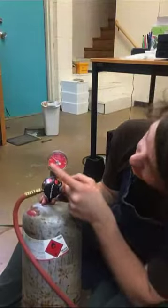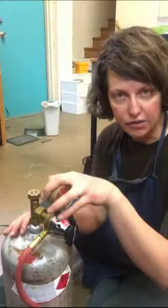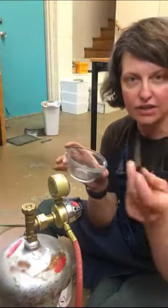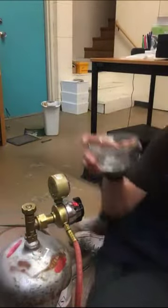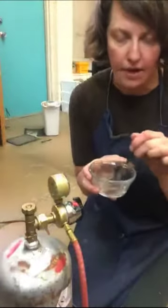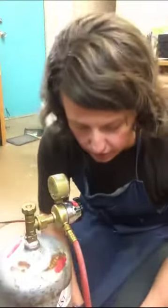This is telling me that I have an almost full tank. As I use this, the gauge will go down and will eventually get to empty. Now that you've got gas in the regulator, the last thing you have to do is make sure that all of your seals are good. Nobody wants acetylene gas leaking all over the place. What I use is just a paintbrush and a little dish with just a splash of Dawn dish soap, and then you want to get a little bit of water and mix those two up. If you've ever had to check your tire for a leak, it's the same principle — if you paint this soap and water solution onto the seams, if there's a leak, there'll be lots of little bubbles. So we just need to check it and make sure everything is good.